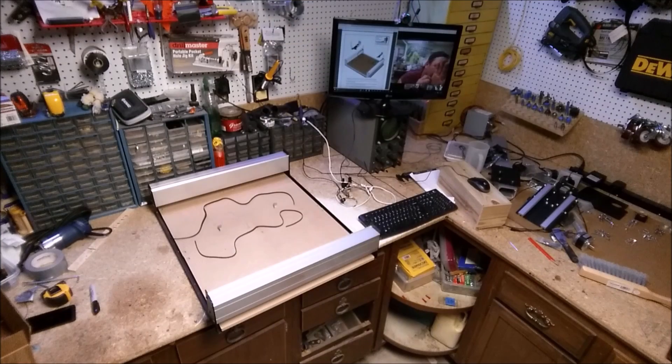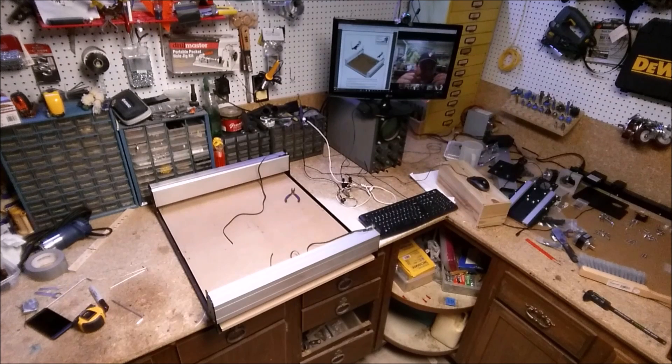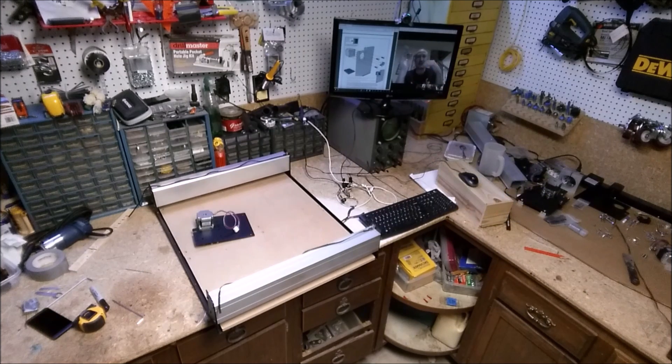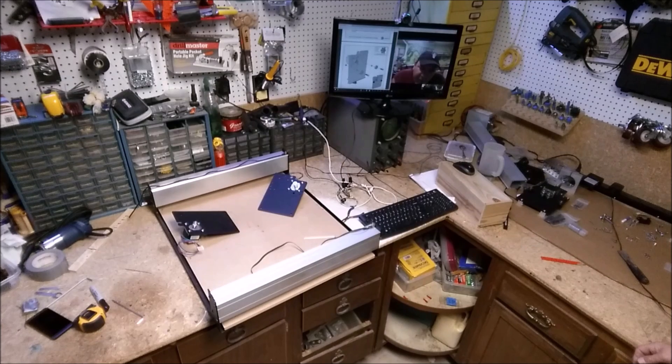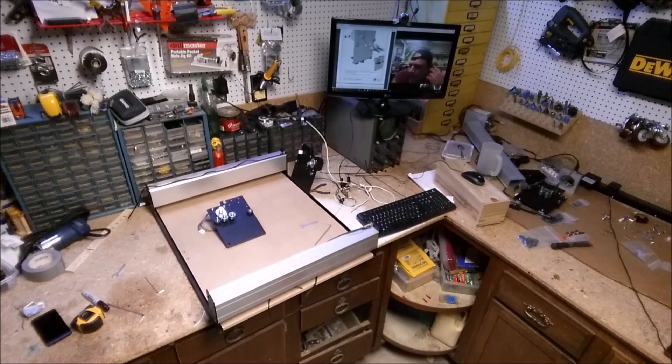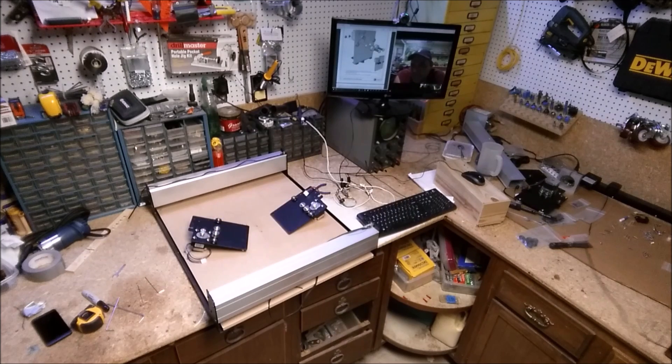To assemble the x-axis trolley I first got out the drive belts and attached them to the ends of the two y-rails with one of the belt clips. Next I took the end plates and installed a servo on each one. The servos are mounted in slotted holes so you can adjust the belt slack later on. There are two belt guides made from four bearings with flanges on one side — just make sure the flanges are to the outside when you mate them together. The rail wheels also go on at this time. The lower rail wheels are mounted with nuts that have an offset round shoulder on them that you'll use later to tighten them to the rail.